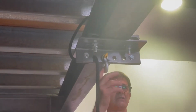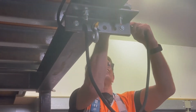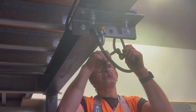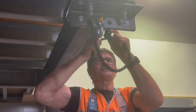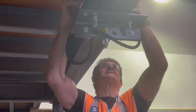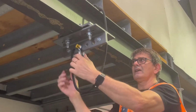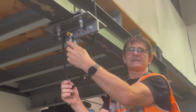If you have a shackle and a pulley with a pulley system on there, you will leave enough slack in this before you start to make your tie off. So you'll leave some slack in this completely. You will then tie the other end of the rope to the first end, which I preset with a loop. And once you're satisfied that the knot you've tied is safe and strong, you will then maneuver it around so it sits on top of the beam, out of the way, making sure that it doesn't interfere with any of the rigging underneath and the safety of the user on the apparatus.